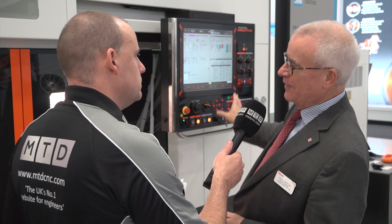Coming on to the smooth control elements or smooth functions, just elaborate on the turret — you talked about power and speed. Yes, the turret has a new integrated spindle drive for the tooling. Our previous turrets had a belt drive, which can introduce vibration. But this new turret can have 5,000 RPM and 5.5 kilowatts. The tool change time from milling cutter to milling cutter is less than the previous turret as well. It's all part of Smooth technology — we've got Smooth G control, smooth axis drives, and the smooth mill drive for the turret. Mazak are paying a lot of attention to the power and performance on the milling aspects on the turret, and that's a key part of the process.